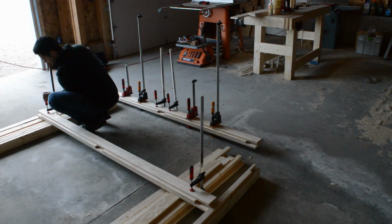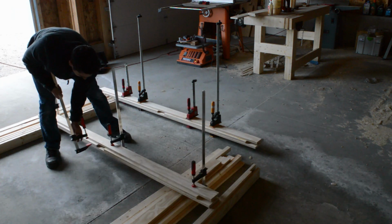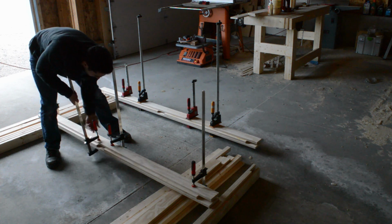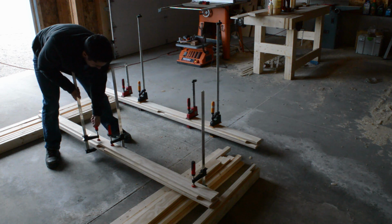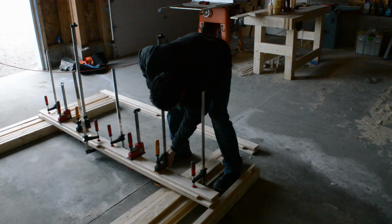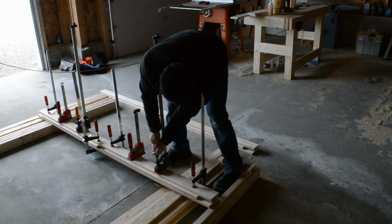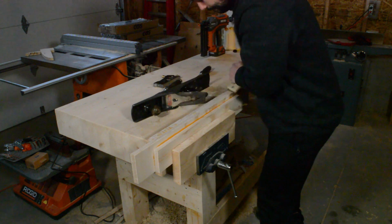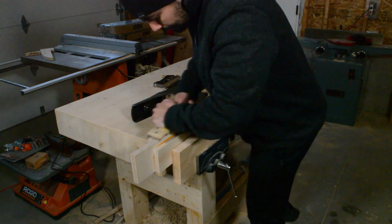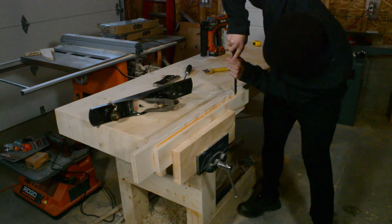As I'm assembling the components, I'm putting them into clamps as seen here. Although I am brad nailing the pieces together, it isn't enough force to get a nice tight bond. The brad nails are just simply used to hold it into position to get them into clamps. When the glue is all dry, I go back to scrape and chisel off the excess, as well as tuning all the components for a slight height mismatch, and do this with a number 7 hand plane.